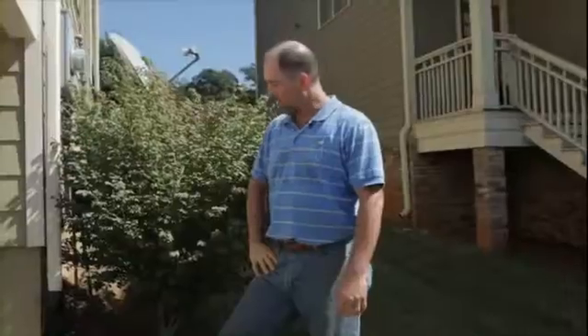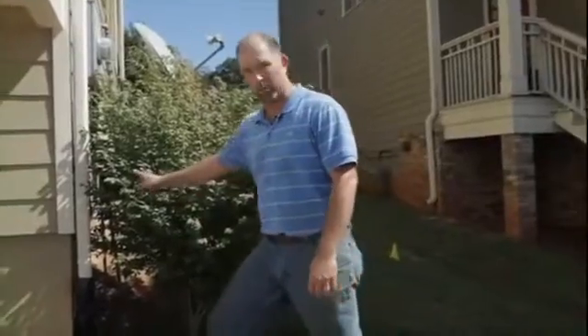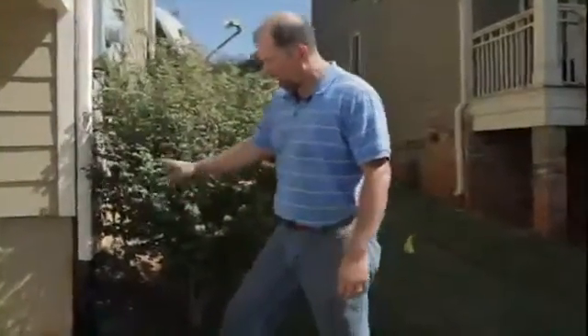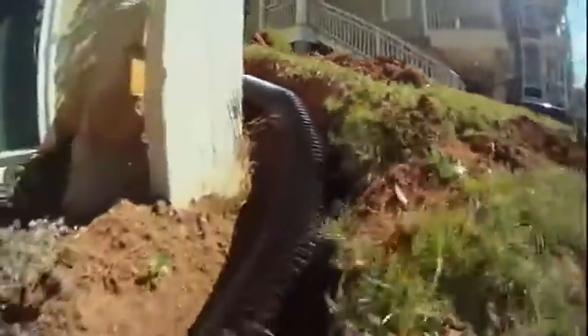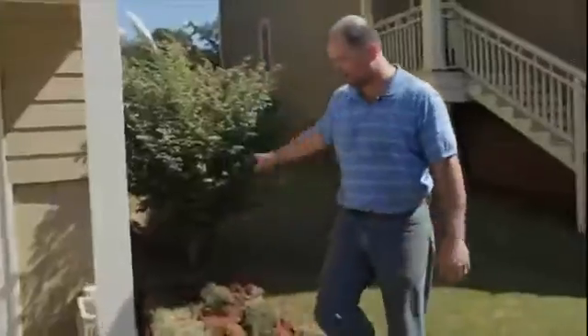Just like on the other side of the house, we have the same problem with the downspout adapter. We've already dug our trench, put our pipe in place, connected our downspout adapter to our Flex Drain pipe, ran the pipe through and around the pole, and simply connected it to a grate drain right at the end of the driveway — stopping the erosion, simple and easy.